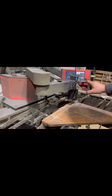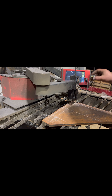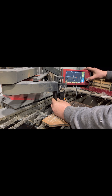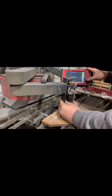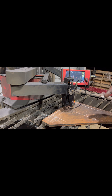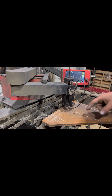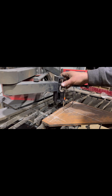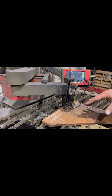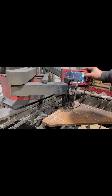Right-hand cut, half-inch lead, one-inch hole. Then I'm going to go right here to the freehand draw and do a line from right here to right there. Basically what that's doing is it's going to cut both of these holes and then come through and do this line, and once it makes its full loop we'll have two complete parts.